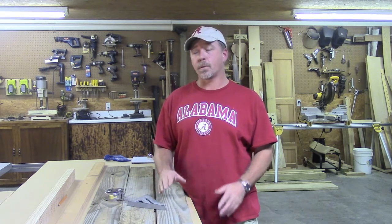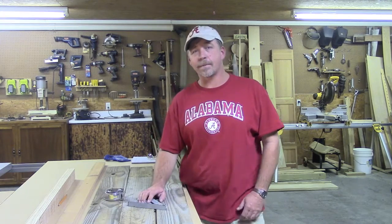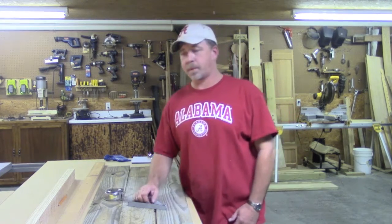Now, the key to a floating shelf is its frame. Depending on what you're wanting to put on your floating shelf, that's what I would accommodate the frame for. The frame mounts to your wall. Now, this particular floating shelf is going to have a satellite receiver placed on top of it, so you kind of want to beef the frame up a little bit.